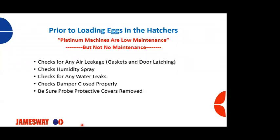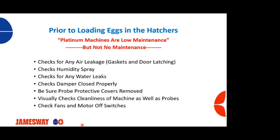We want to make sure that our probe protectors are removed. Check for visual cleanliness of the machine and our probes. And again, we need to check our fans and our fan sail switches to make sure that they are positioned properly and that the fans are rotating properly and are blowing in an upward direction.